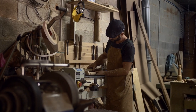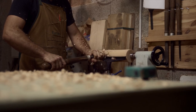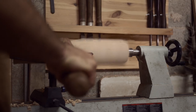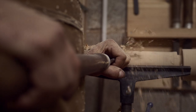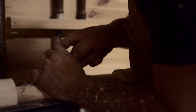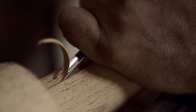I was asked to remake a column for a member of the church. One column remains, and the other has been lost with time. So I'll remake it identically — it goes to the sculptor, and Madame Bellwine will do the gilding afterward. I've already roughed out the piece and made a square block. From this square, I'll turn it round on the lathe. Once I have the round form, I'll better see the piece. I'll then work on the chapiteau, the base, and the fût. The fût I'll sculpt like it is on the other column — that's what we call a cannelure. And at the bottom of this column, there is what we call the contre-cannelure, a part on the inside of the cannelure arranged in the opposite direction.